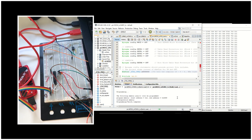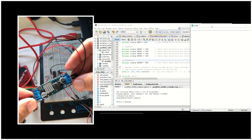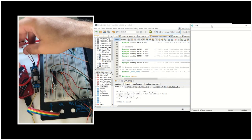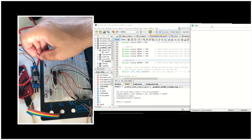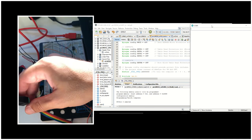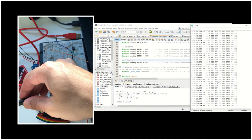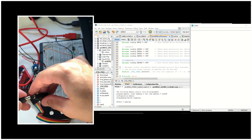Now what I'm going to do is connect a 5 volt regulator and supply 5 volts to the circuit — to our microcontroller. I've already disconnected the PICKit3. The NRF module is still getting 3.3 volts from the launchpad. When I connect it to a 12 volt adapter I'm getting 5 volts to the circuit, and you can see that I'm getting the values on the receiver side as well. So it's working properly — my transmitter is working properly.